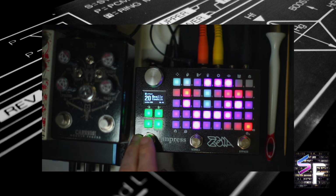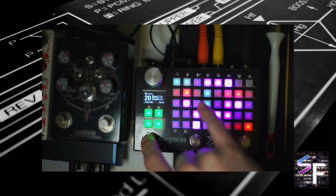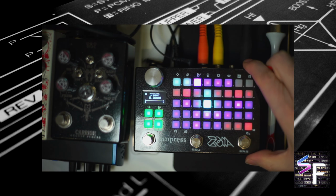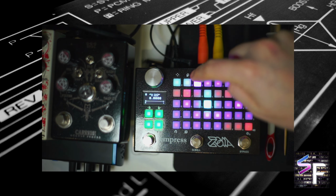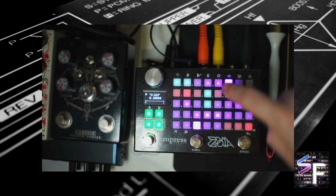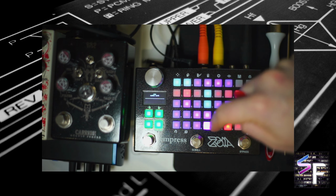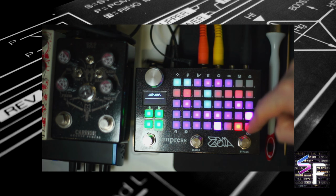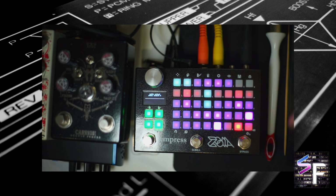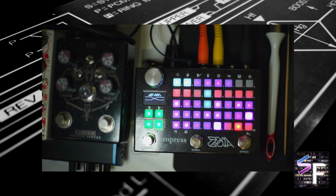And this is one of those examples where this is assigned. As you can see, when I press the switch, the lights blink, but without actually backtracking what is going on. So here we have the switch. If we press it, it goes up. Okay, cool. That goes here to a slew limiter to make sure it doesn't switch instantly. So we should see a reduction signal here. It goes from here to this point, and this is the VCA level control. So we have a VCA here. Okay, that's interesting. Which controls audio output pedal right channel. Okay, so we need to be in stereo, and this way you need to move through everything to find out what is going on, which can be very annoying.